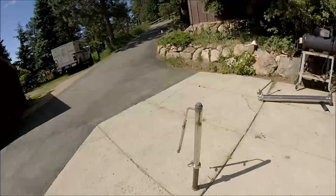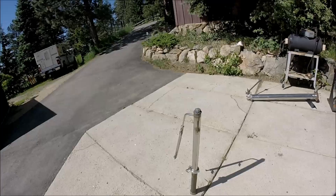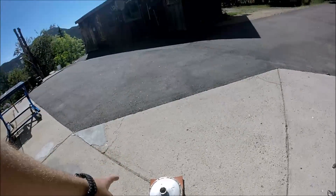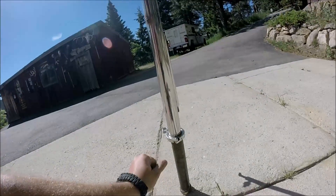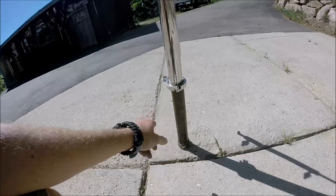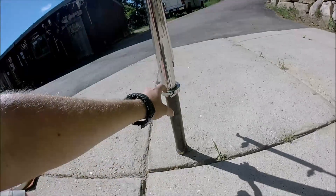This is the second revision of my distillation tower. I took the bottom portion and replaced it with a narrow chunk of quarter-inch wall steel tubing with fittings, and then there's a stainless cap to weld it all together so it doesn't leak there. But this still leaks unfortunately.